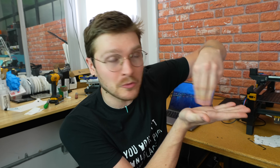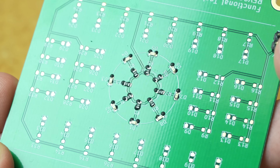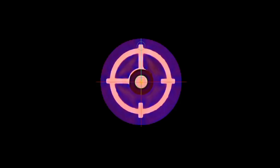There are definitely some things to tweak. My positions for some of the LEDs were not great — when I grabbed the positions I was just literally writing down the coordinates and I don't think I was that accurate. That's why some of the LEDs aren't lit up anymore and the ink was not perfectly centered. This is partially because the script I wrote for ink deposition does not have any vision alignment associated with it — it's all totally dead reckoning, so all the benefits of fiducial homing that we have for a normal pick and place job don't happen here.